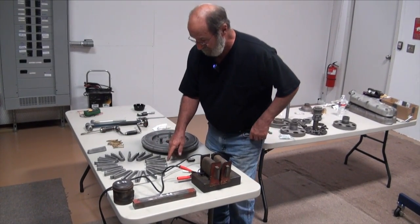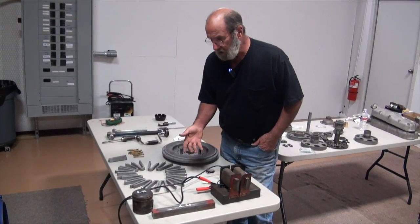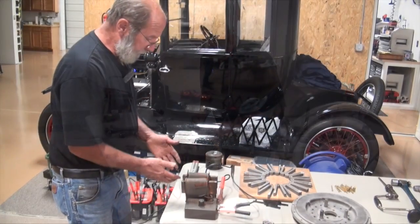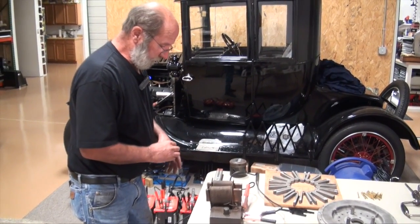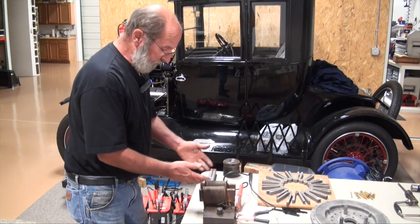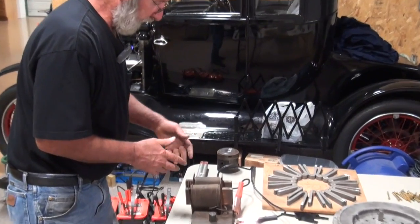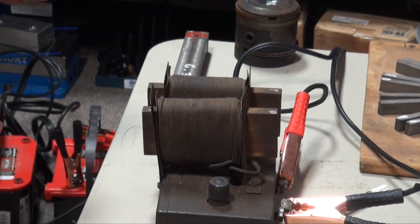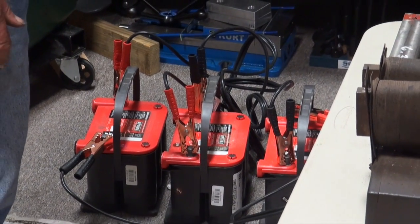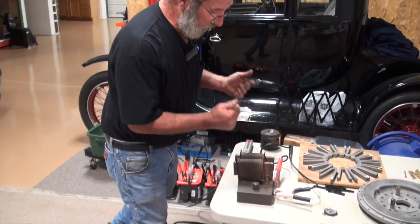I like to do the orientation north-south because I don't want to reverse the magnets when I do the charging. So let's talk briefly about what we're getting ready to do on the charging. This is a homemade magnet charger — one of the guys in our club probably 40 years ago made it. He simply wound some coils around some steel, with a little starter button that you push to get the voltage up to it. What we use is three 12-volt batteries wired in series, so we end up with 36 volts at our charger.